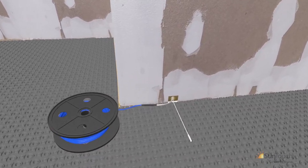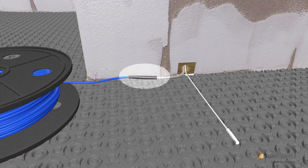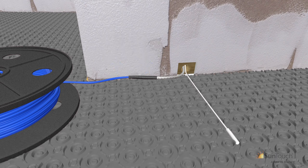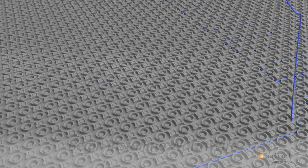The first step to installing the heating cable is to feed the Warm Wire power lead and floor sensor wire into the electrical box where the thermostat will be installed. A black splice connects the power lead to the heating wire and is positioned close to the wall entry point to allow the power lead to reach the electrical box. Trim a small rectangle out of the Heat Matrix membrane to allow the splice to sit flush against or below the Heat Matrix surface, and secure the splice in the space provided with thinset. Place the floor sensor in the area to be heated, planning a location that keeps the sensor wire from crossing over the heating cable wire.